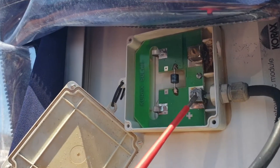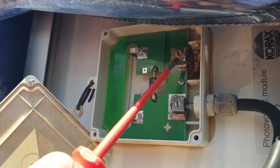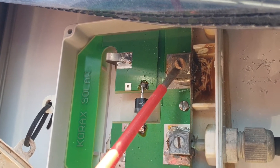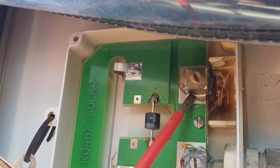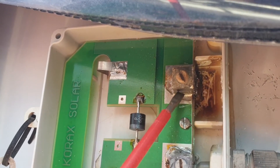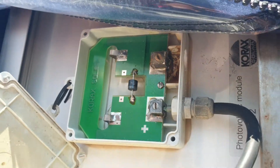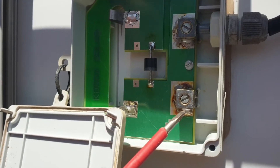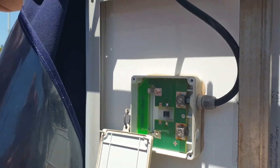The main problem with the new cable is that it's a smaller diameter, which means our through-hull fittings won't be particularly tight — which is not good for water ingress. So I'll put the old one back since it's checked out okay, and keep the new one as a spare. That means the only problem we should have is the actual connection at the solar panel, which will need to be cleaned up thoroughly. What I've found is that this terminal here has become disconnected from the solder around it — that's what's created the heat and the poor joint. However, on the other panel we have a spare connection, so I'm going to re-route the cable from the top panel to the bottom panel — that should solve our issue.